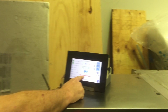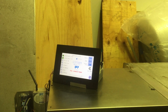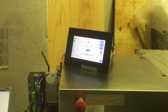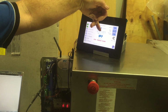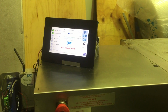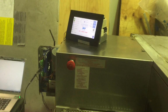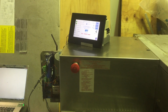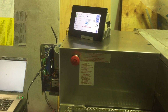So yeah, we've got that check temperature error here as well. Yep. F20. So I've got errors. F for fault, F10, F20, F30. It'll tell you the TFT screen version and the MCU version, which is what we've got in there, 1.6. So basic fault finding is going to become a lot easier. Virtually over the phone, talk to the local electrician, have a look on site, and you can literally walk them through it on FaceTime.